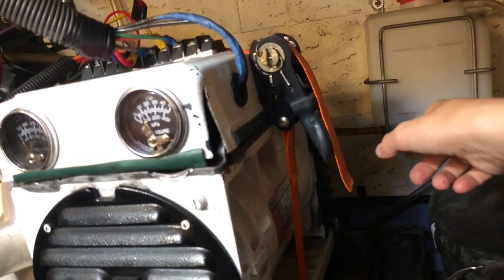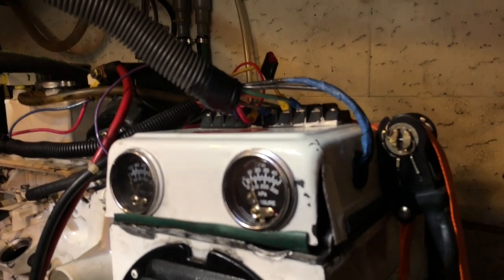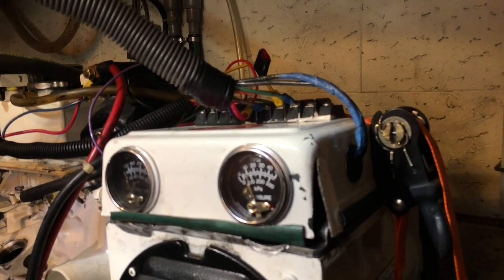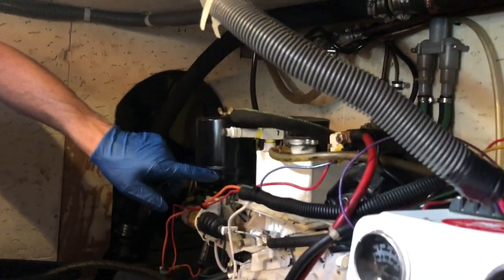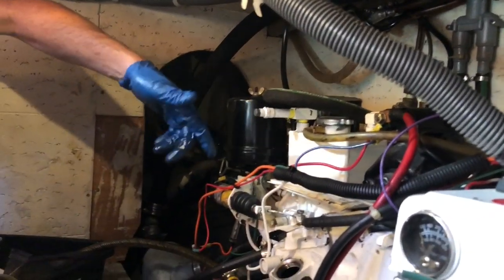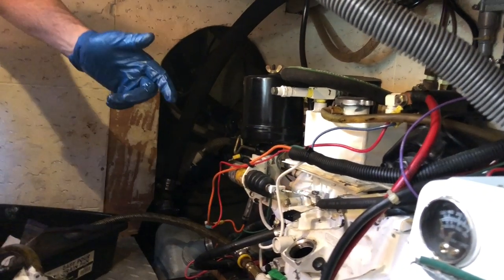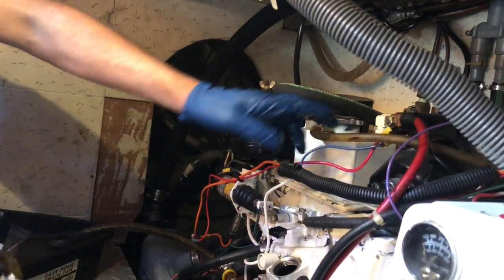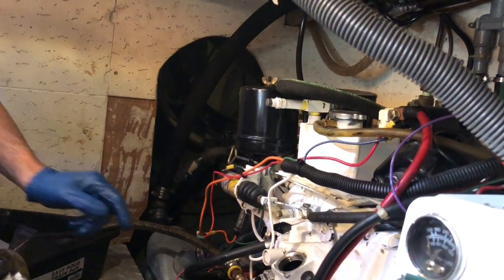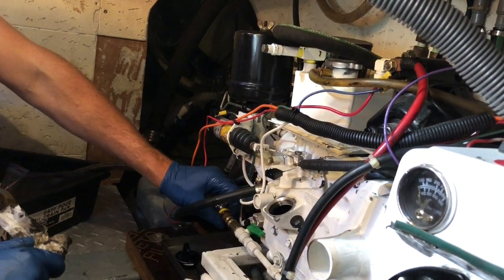What's this green stuff? White stuff too? That is coolant — that is the overflow tank. This is your coolant tank right here on top of the engine. When you fill it up cold and the engine gets up to operating temperature, the fluid expands, so it goes out through this little breather hose and into that overflow tank, as opposed to spilling all over — or into the bilge, rather.